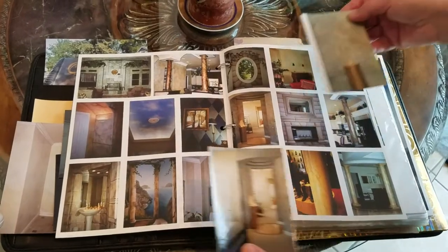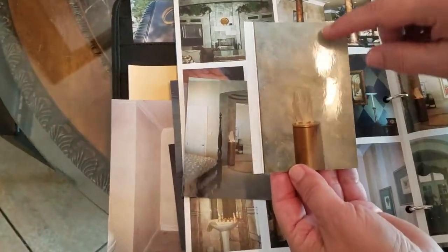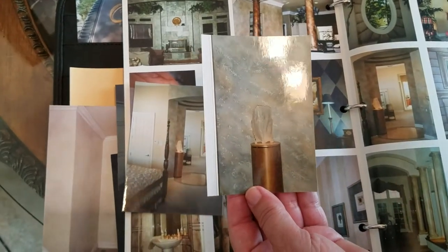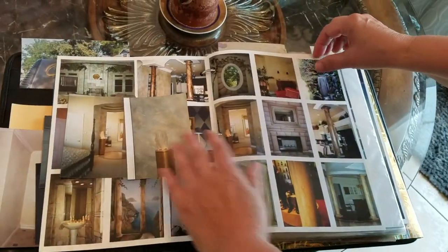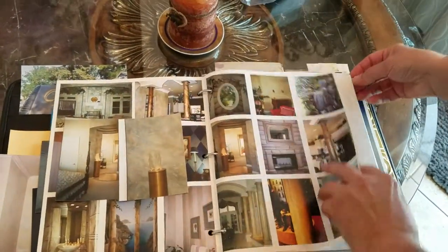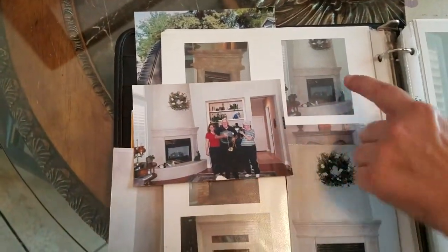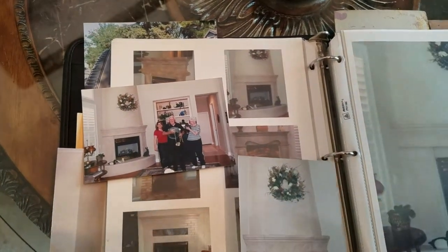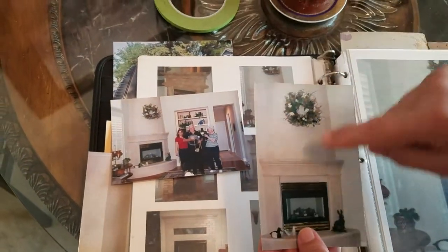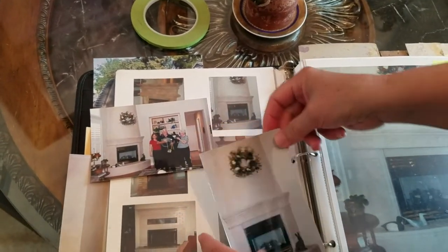Here is the texture look, done more exaggerated — a little more extreme because that's what the clients wanted. This one is at the fireplace — color and joint compound — the fireplace is existing. Above is not. I used auto detail tape, which is quarter-inch tape, and mapped out a design with a level and a pencil, then created the illusion.